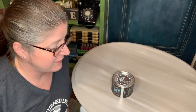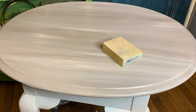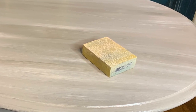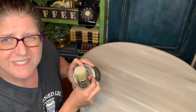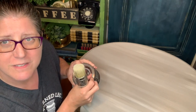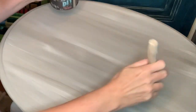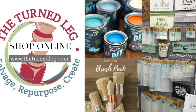Here's a quick tip: you can apply DIY clear wax after your two coats of Big Top have dried. I like to make sure to sand with 320-grit sandpaper in between so you get a really smooth finish, and then I apply my clear wax. This clear wax adds just a little extra protection to your piece and provides a really nice shine. Once the wax dries, I will buff it with a lint-free cloth.